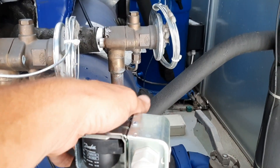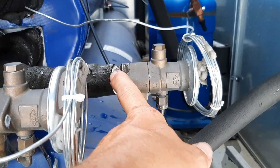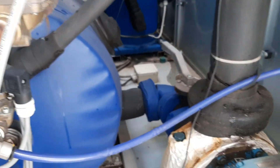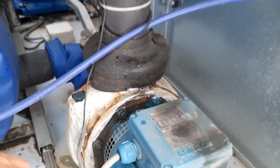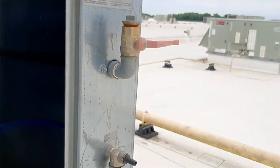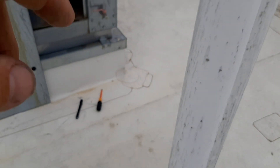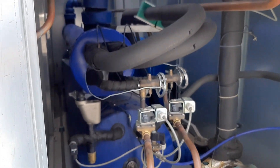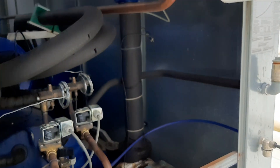You can see right on the outlet of my valve there's frost on the tube — it's going to be energized. I don't see any strainers or anything on it, at least not up here. Might have something down below — I haven't checked down below yet. I might have a way to lock that out down there. I'm going to dig through that control and try to lock that stage out and let the other stage operate.